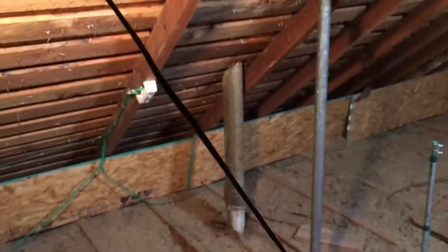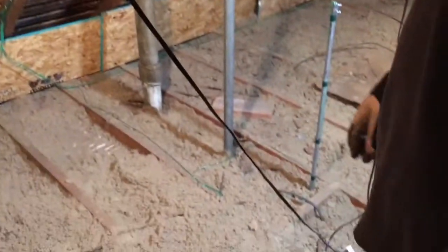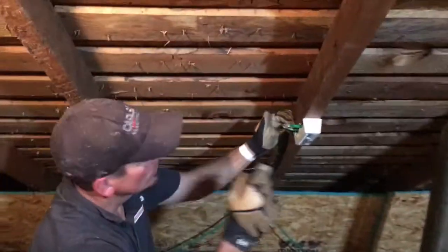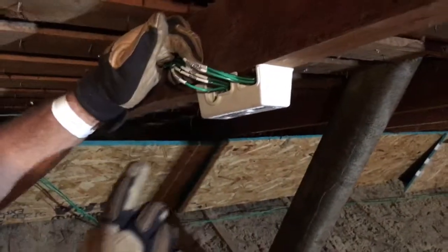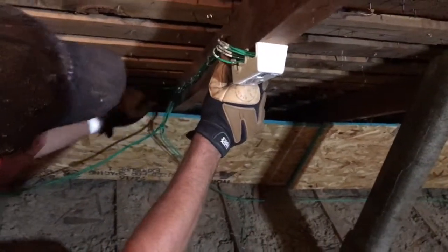When I ground, I make sure all my grounding is to the back side, and the GC guy is going to put in some insulation about two feet deep or 18 inches to increase the R value. This is my bonding bridge bar, and I went ahead and labeled the rooms that I grounded. I did not just daisy chain box to box to box — I actually home-run everything to that room and stapled it and brought all of these EGCs up.